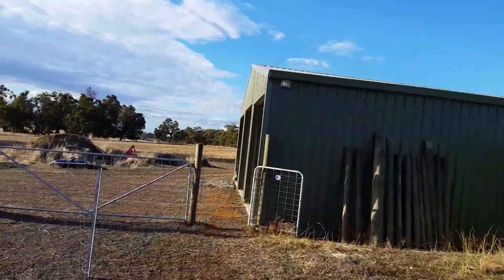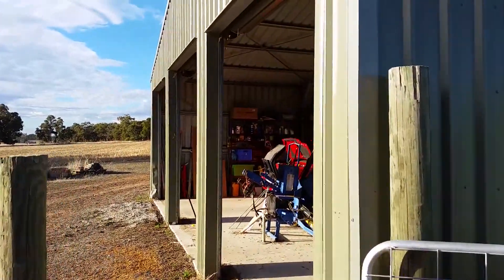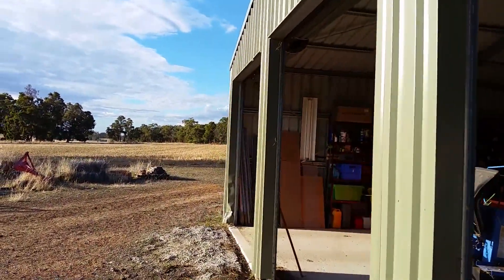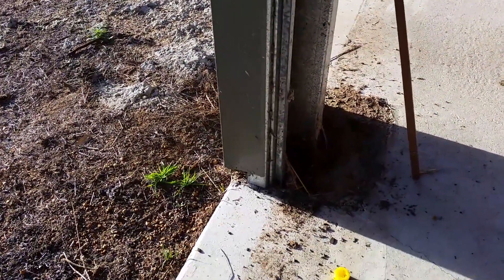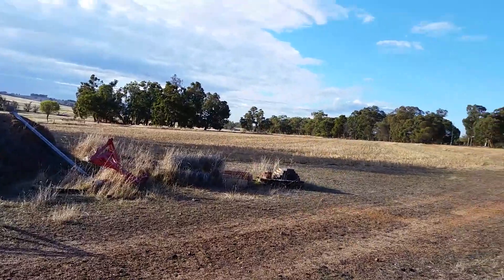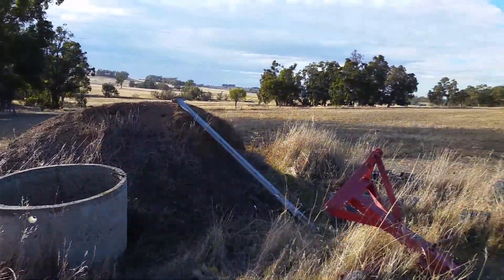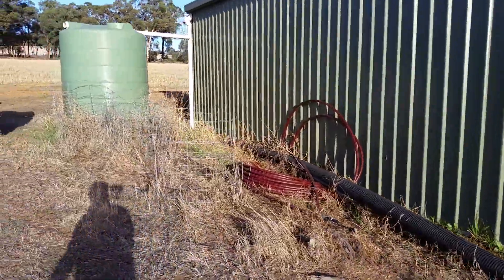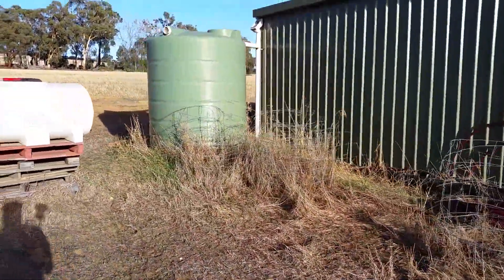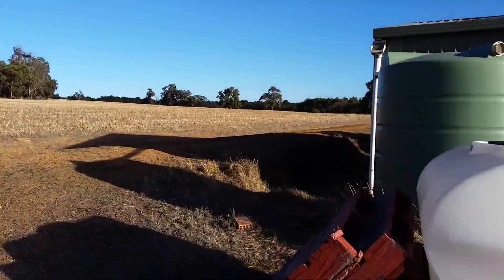When I chose to build the shed, I built it on stumps. I set the post holes into the ground and poured the concrete in. You can probably see in the new pad where the edges of the stumps were. I raised them up a hundred millimeters above the ground to start with. First of all, I dug out the topsoil, cleaned all that off, and then I did a cut-only approach. On the farm where I don't have a compactor, cut-only is probably a better way to go.